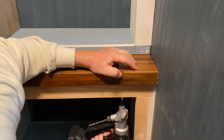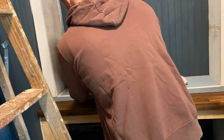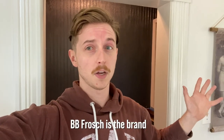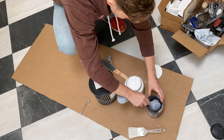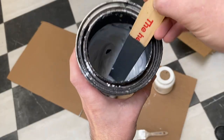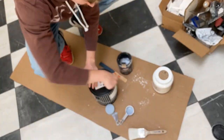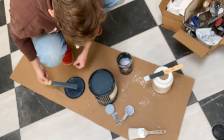Day three — we're ready to paint. We went ahead and installed the countertop on the right side and the cabinet above so that I was able to caulk everything in and get it prepped for paint. This time I'm experimenting with an additive that will make it into a chalk paint type thing that should stick to anything. I'm doing that specifically because the cabinets I'm painting have that classic orangey oak glossy finish, and rather than spending hours sanding it down so that it holds the paint, hopefully this will just bond like glue and save me some time. Fingers crossed that works out.